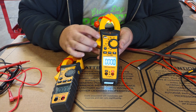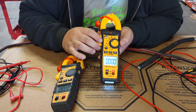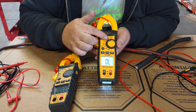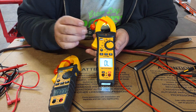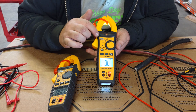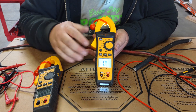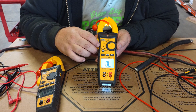You're able to do hertz in general with your probes. You can also do continuity testing and diode testing, which is a huge advantage. Continuity testing is something we do constantly. Resistance testing is a huge thing we want to be able to do in the solar world, so it's great to have that as well.